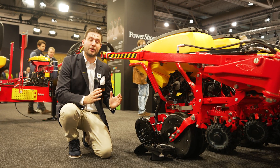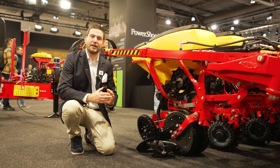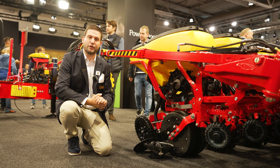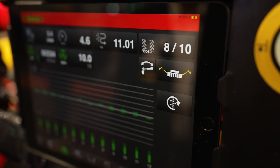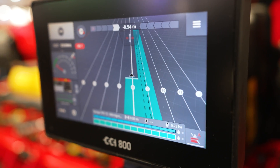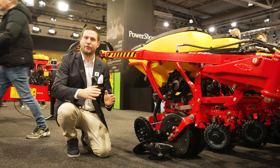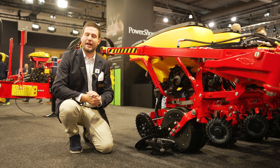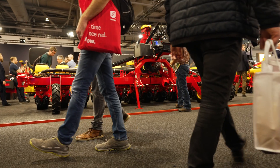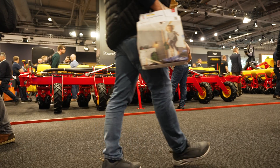One addition on the software side: from spring 2024 we now have the possibility to have ISOBUS tramline control on our Tempo models. That means we can set the tramline together with the ISOBUS screen, which allows us to go not only line by line — we can have different driving patterns on the field and the tramline is always in the right position. These features will be available quite soon for TPF, TPV, and TPL models.